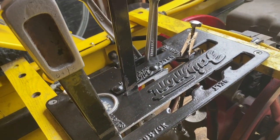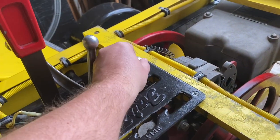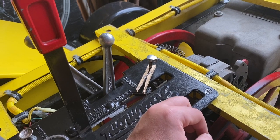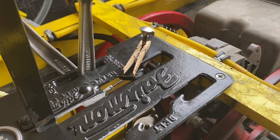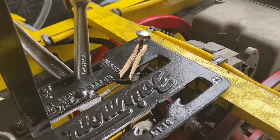So the way you're going to start this car is with the ignition off. I'm going to open up our mixture control. I go to 3/4. Manuals say one thing. A lot of operators say different things. This car, from my experience, seems to be happy at 3/4 open.